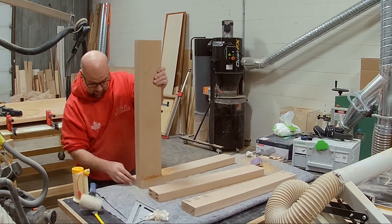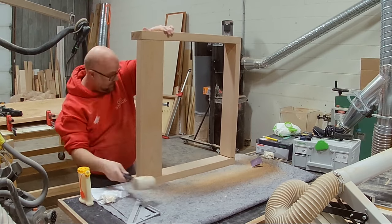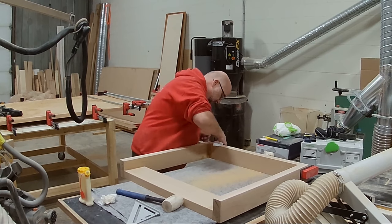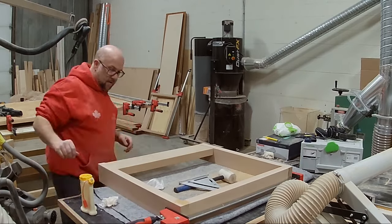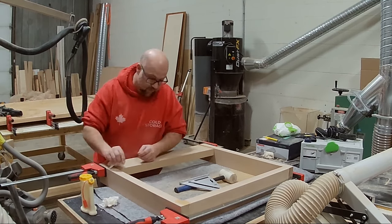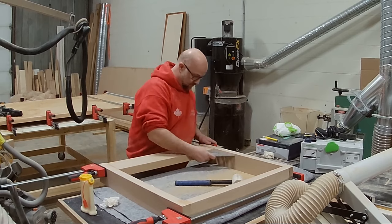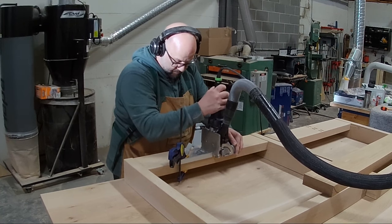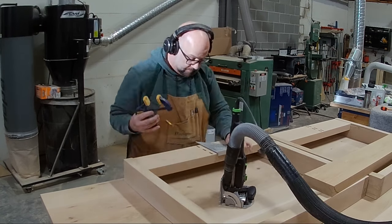I've glued up those tenons and I'm putting them in, just making sure I wipe out all that excess glue. If you don't wipe off excess glue and you go to stain it later, the stain doesn't apply properly and it looks blotchy. I really take my time cleaning out all that glue squeeze-out — every time you tighten those clamps a little bit of glue will squeeze out. You can use a wet rag, sometimes a toothbrush. I'm using baby wipes — that's just what works for me, it's easy and convenient.